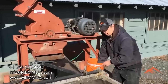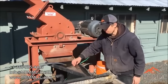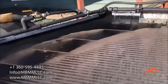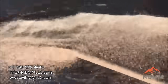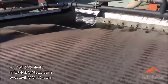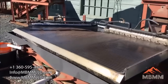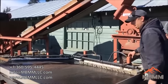We're about a third of the way done with our second sample, and this looks a lot more like what we're used to seeing when we grind up boards — a lot of plastic waste going down into the tailings, and then the heavier metals, the copper and probably lead and tin solder, going off into the high grade. The table is doing a really good job of separating the light plastic and waste flowing down into the tailings from the heavier metals working their way over to the high grade port. Because there's so much waste in this, I can feed it a lot faster.